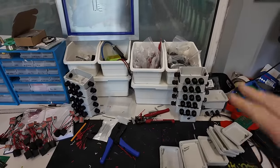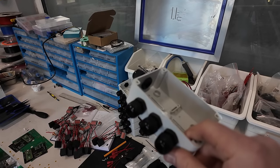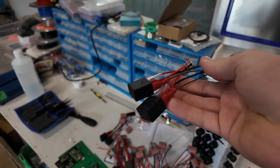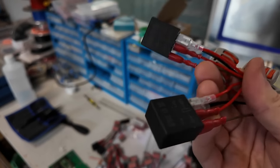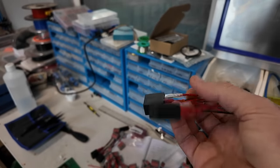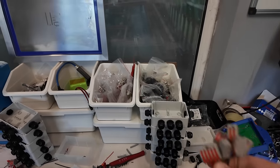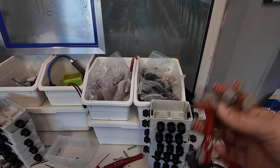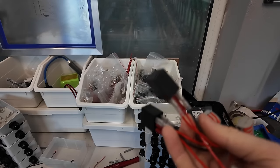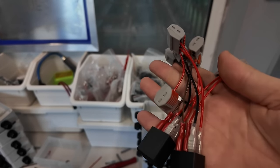I've also got the machine side cases prepared with five waterproof glands on them. This assembly goes into each one and basically controls the two high powered relays which our little orange box turns on and off. Our big seven-core control cable comes in here, connects into this block of connectors and drives the relays, which turns on and off the hydraulic solenoids. Our flow meter also connects into this bundle of cables.